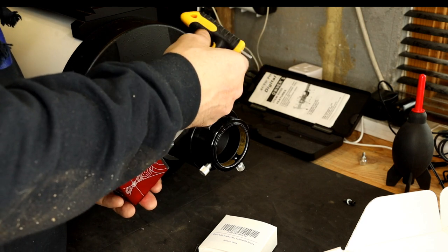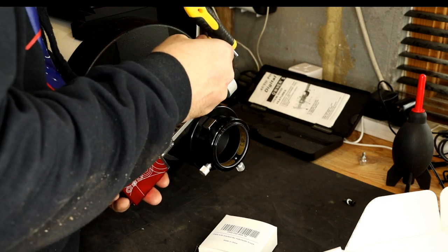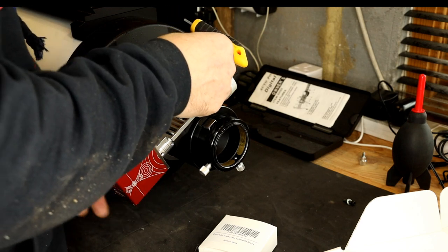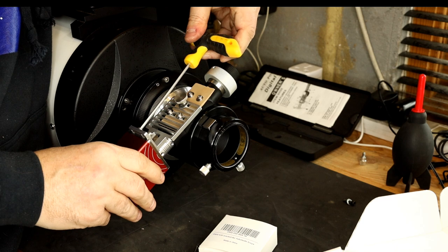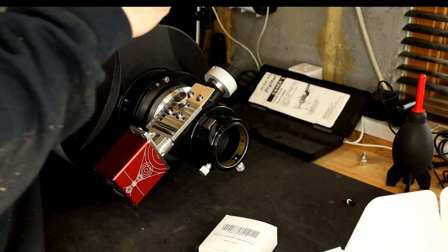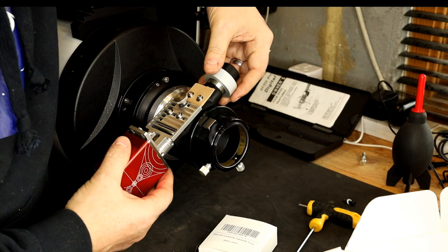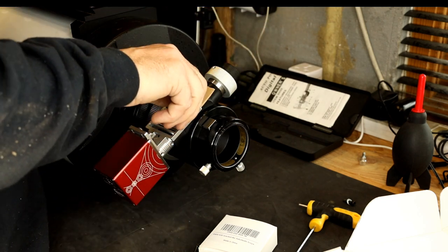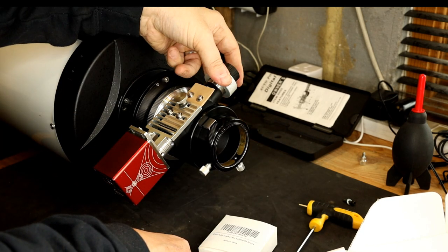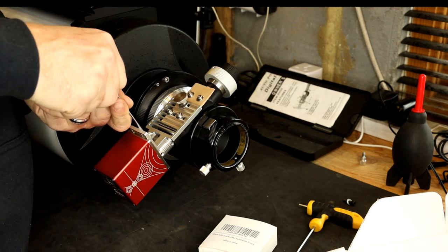Just make sure everything again is nice and square, and we just give these a little turn. Make sure they're located before you start tightening up, otherwise you'll find them even harder to get into the correct holes. And we just nip them up again. Don't over tighten things. So that's looking good. That is nice and firm, and that looks like that's installed quite nicely. Good, I'm quite happy with that, everything being held nicely. So what I'm going to do now is just nip these up,